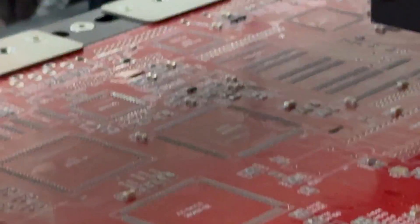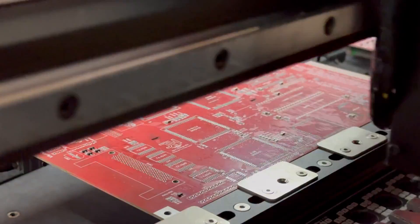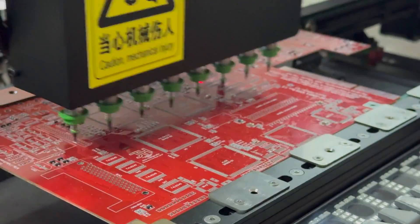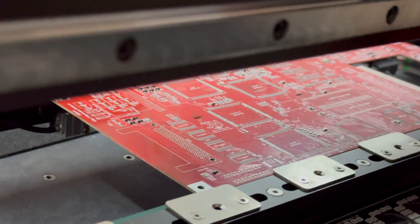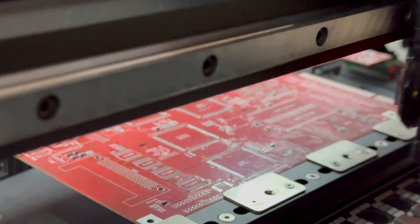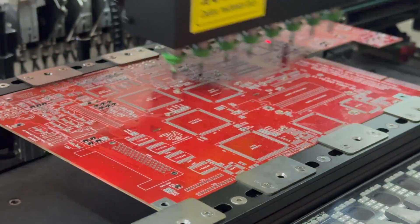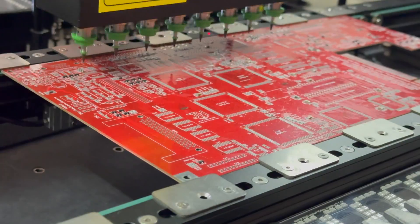I place the components on the bottom, then go to the reflow oven, and then I place the board on some sort of standoff to make sure I don't knock off the components during the reflow process for the top side. For me it works just fine, although it's a little bit more effort and labor involved. I just want to make sure that whoever buys these boards from minimig.ca, a generous amount of the proceeds will go to John as support for his fine work. Just a heads up — I won't be doing this on a large scale. I'm going to produce about 10 boards, and then focus on AmiCube development. But at least once in a lifetime, assembling and producing Amiga 1200 this way is just a pure pleasure. Keep you posted — thanks for watching and I'll talk to you soon.